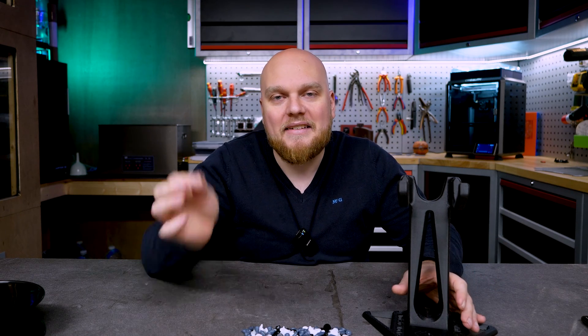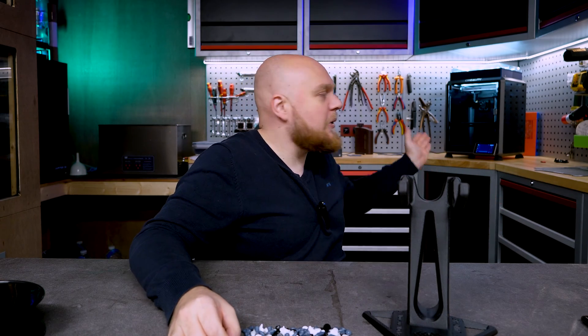Should you buy it? On the Creality K1 it's a real pain to change the nozzle, so the less I have to do it the better — that's why I bought this. It's an all-in-one nozzle: CHD for increased flow on materials that can benefit, plus hardened steel for carbon-filled filaments. I mainly print with ABS Plus and some exotic materials, so for me this nozzle is absolutely excellent. That said, it's hard to say everyone should get it — the PLA Plus and PETG didn't perform well, though that could also be a printer extruder limitation. Future testing will tell.